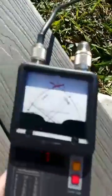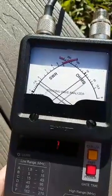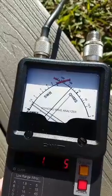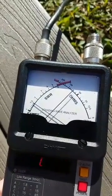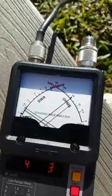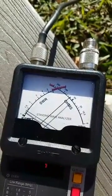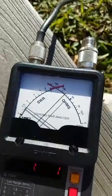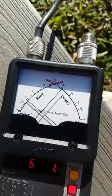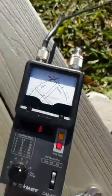There's 140 MHz, scrolling through 141, 142, 143, 144, 145, 146, 147, 148, 149, 150 — look at this thing just go. That's 154 and it's only up to a 1.5 SWR. Where does it top out? 156.855 MHz.